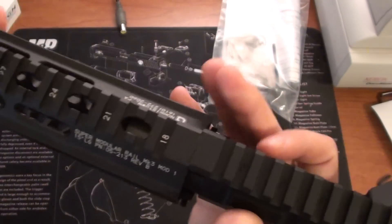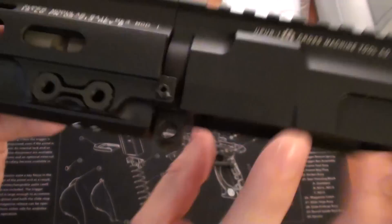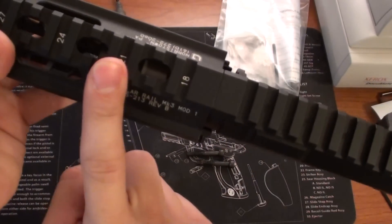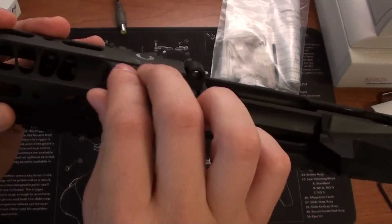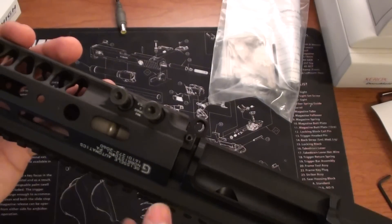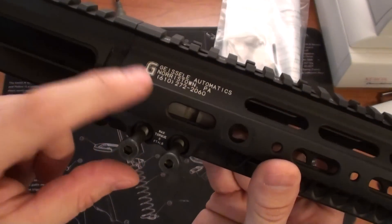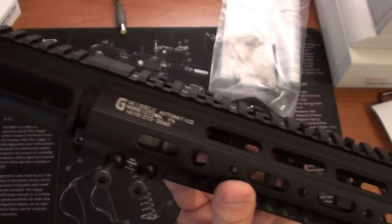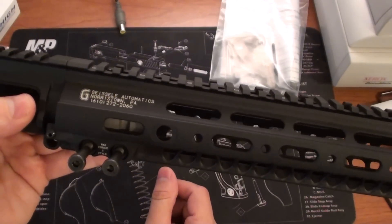Once it's slid on, you merely have to align your top Picatinny rail by hand. Then you've got a set screw on the left and on the right side — you tighten those down and that will help ensure your alignment from your upper receiver to your rail. Then just tighten down these cross bolts. It's extremely rigid, more rigid than you would think for the way it attaches. Companies like Centurion Arms and Daniel Defense with their modular rail are wising up and going with a similar mounting system because you don't have to deal with timing for the gas tube. Just really easy — popping these two screws and loosening the set screws, you could pull the whole rail right back off the gun for any maintenance on the gas system.